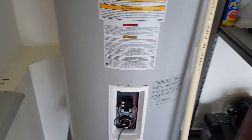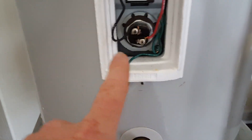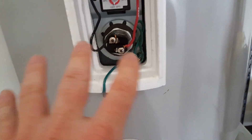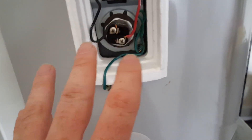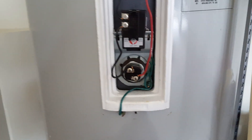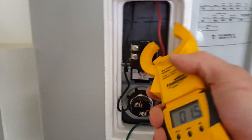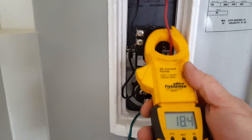We've got a water heater — we replaced the upper and lower thermostats and it's still tripping. We already ohmed out the elements and we're getting 15 ohms. These are 3,500-watt elements, and based on the ohm chart for 3,500 watts it should be right around 15 to 16 ohms. Our ohms were showing good, so I personally made the mistake of not going any further and replaced just the thermostats, thinking the elements were fine.